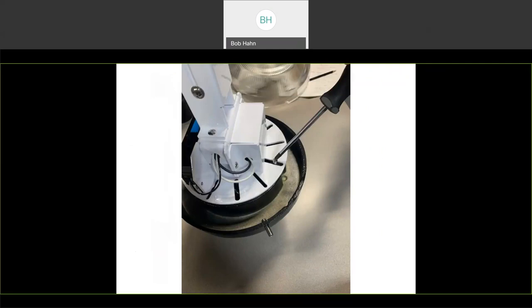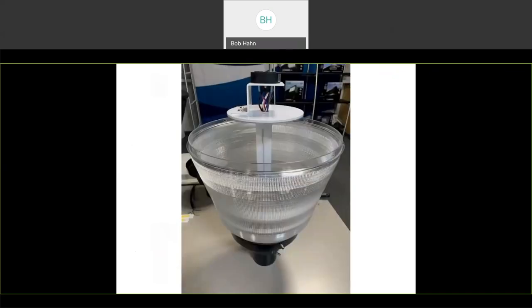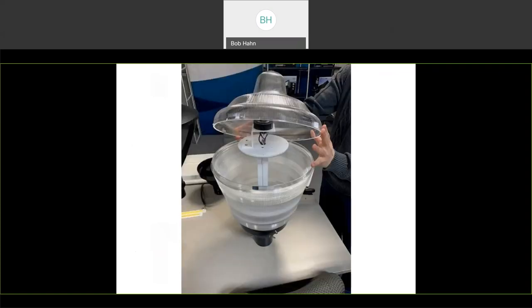These are all things that can cause the HID lamp or another type of retrofit kit to shake loose or even break off the socket. This is a much firmer, more robust mounting mechanism. Then you'd slide the globe over it — whether it's a two-piece or a one-piece globe, it easily slides over and tightens into place. And even in the smallest of globes, typically we can fit a wireless node in there too, if need be. Without the node, the kit fits in very nicely, even to the smallest of globes.